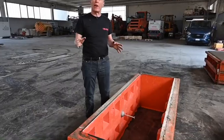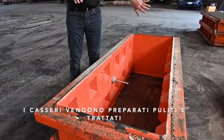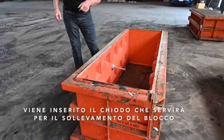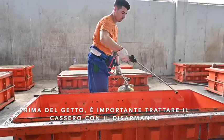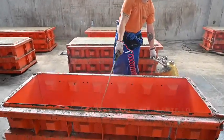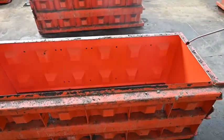The customer has prepared a couple of other moulds to be filled. All of his moulds are the same size since he's currently using them for himself. The mould has been cleaned and primed — this is done the day before the pour. There's a screw inside so you can move the block once it's made. It's very important to prime the mould with diesel or a certain primer, which allows you to open the mould without damaging the concrete block — this simply means the concrete doesn't stick to the mould.